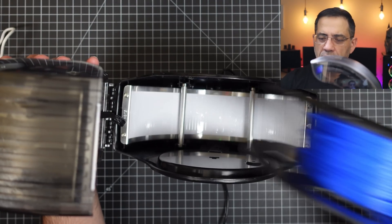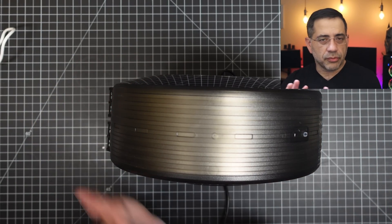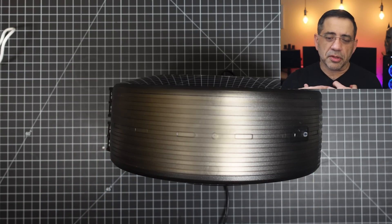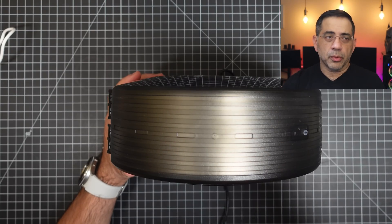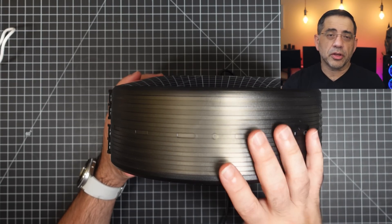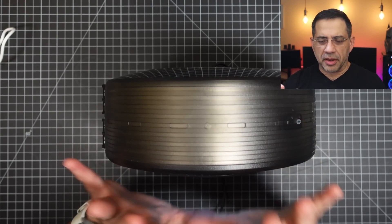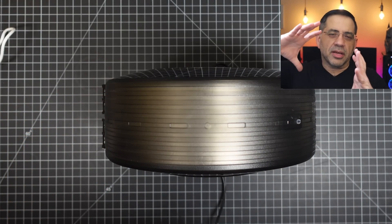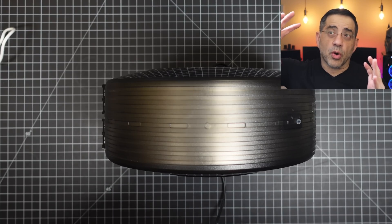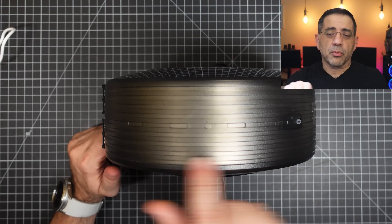What you would do is take your filament, put it in the filament dryer, close it, and just let it run for the duration of the process — five hours, six hours. What I typically do is, if I'm working on large prints, I'll run the dryer first before I run the print, with another roll on the machine. Or before I do my run, I'll put filament in the dryer for at least an hour, then feed it through this little feeding tube and connect it to my printer, keeping it in here as it's working and also drying all the filament. Because the heat is coming from all areas, it's going to dry what's on the outside first and then work its way towards the inside — which is why you'll benefit from running this as it prints.